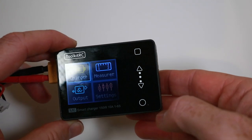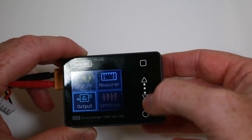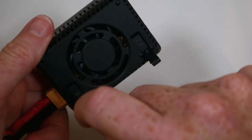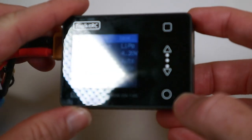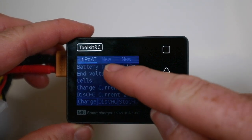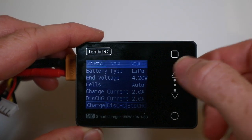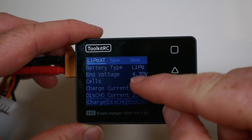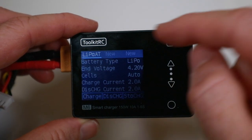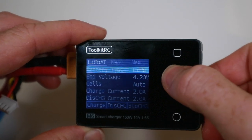Anyway, let's go through the main options. In this situation you've got the up and down keys. That acts as sort of stop or back, and the circle button acts as OK. Along the top here is like a quick thing so you can add another battery to it - this one is LiPo and obviously the end voltage is 4.2. You might want to add a new one for LiPo HV, or another one for LiFe, or you might want to change your charge or discharge current. You can add new types of batteries there, or obviously every time you go in you can always just change it around.